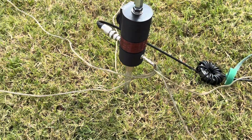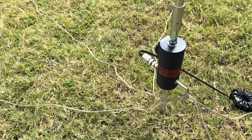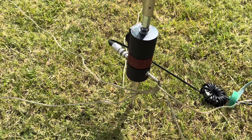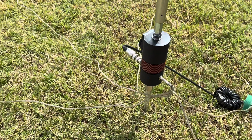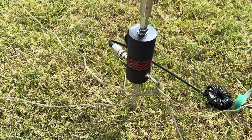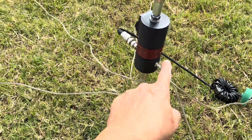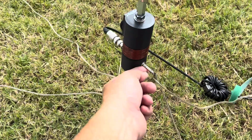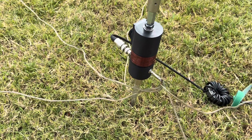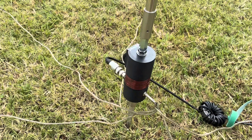So there you go. You just never know with regards to what ground types you're going to be setting up on — every situation is a little bit different. In this case I'm not getting a very good SWR with the radials spread out, but if I group them all in one direction I get a really, really good SWR. Remembering that the ground spike is totally independent — it's not connected to anything in the coil. The ground or counterpoise banana plug socket is connected to the shield of the coax, and the centre of the coax goes through the coil and is connected to the radiating element.